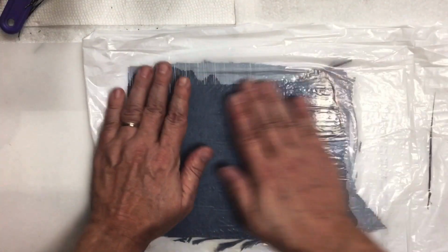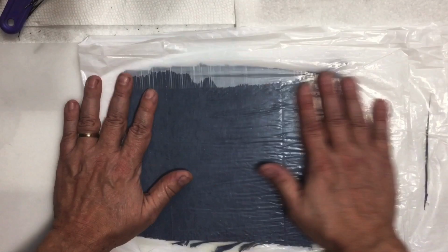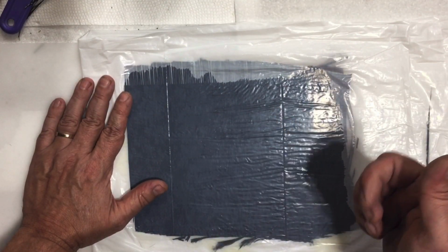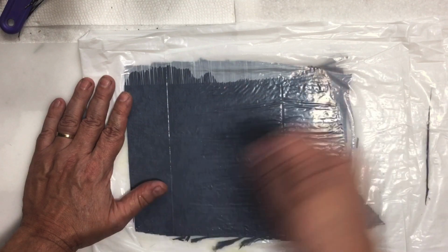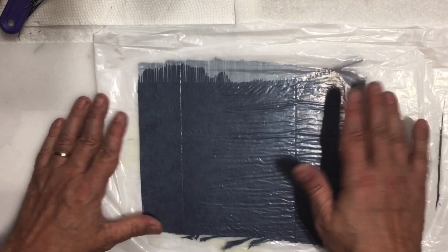And it is soaked through both sides. And remember, I said this is the neat way. Notice I'm not wearing gloves. So far I don't have any resin on me at all. The messy way is to cut out the piece, put it on your thing, and then just start putting resin on it and spreading it around. Then it drips all over the place, makes a big mess. You get it all over your hands.